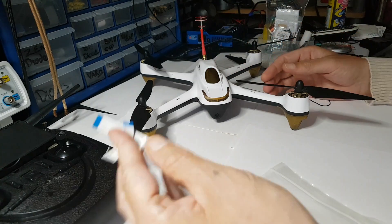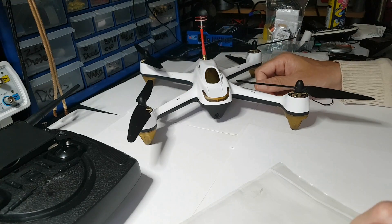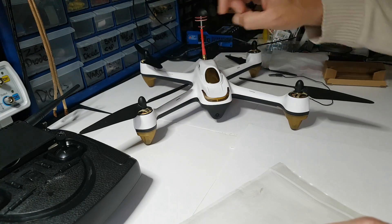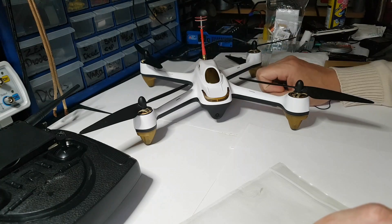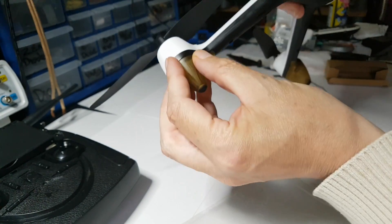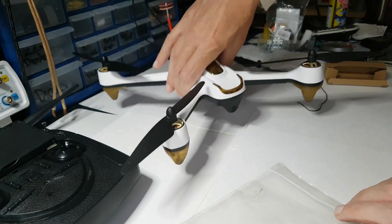I've got to strip it down again because of another wire — I've got to do the antenna mod. I was going to record it all, but I've decided what I'm going to do is — because there are a few tips I can give you about when you take yours apart, just to make it a little bit easier. I'll do another video taking it apart, and I'll show you simple little things, like once you've cracked the top case off, you can put a screw back in here just to get these up out of the way. There's a thread to the bottom part of the case, which means you can have the top off even while you're working on it — you can be moving it around and you won't have these flopping about the place, waiting to come off at the solder joints.